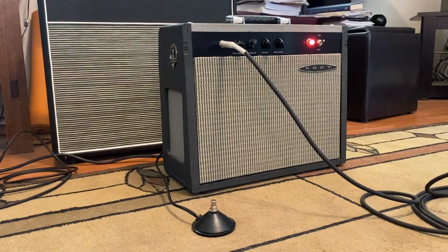It's much better than it was. Sounds pretty good. The audio taper pot obviously makes a difference. It doesn't get as crashy as quickly, but it's still a little too much. I think we're gonna have to mess with that dwell resistor, right? That resistor that is taking some of that initial dry signal and shunting it off to ground.